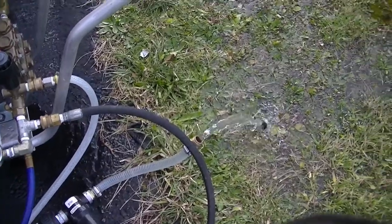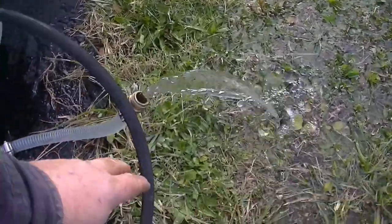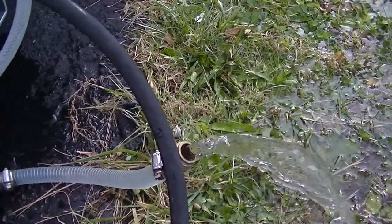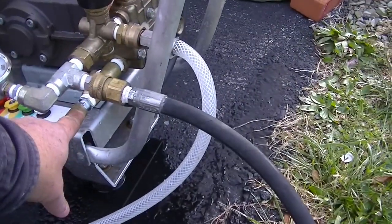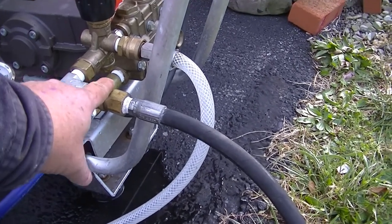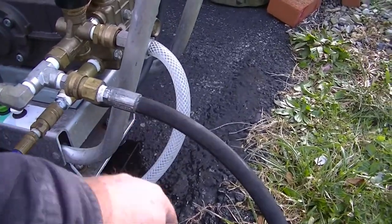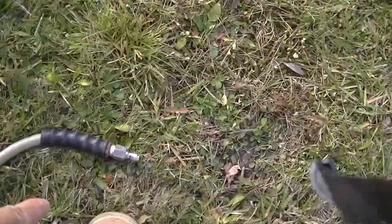All right, I'm about ready to do the pressure washer. I've disconnected the line from my tank here. Since my tank is up in the trailer, it's just bleeding that buffer tank all the way down, and then I'll clean out that filter when I'm done. I've hooked my air up here. It's going to blow down there through the low end, up around the high end, just like the water coming from the house would do, and come out here and blow all the way through the hose until eventually it'll come out this hose right here.